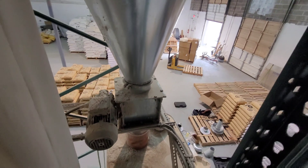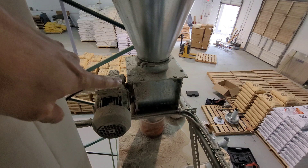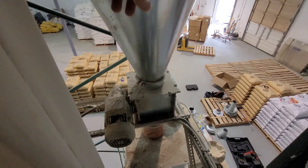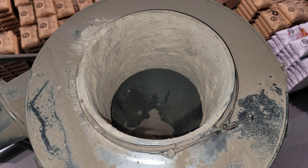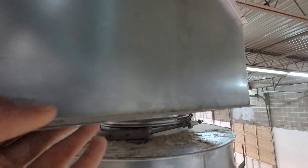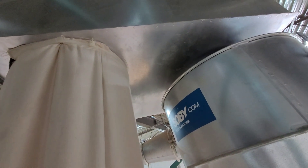So this is the cyclone here. At the bottom there's the paddle wheel gearbox to block off air at the bottom of the cyclone, but the paddle wheels allow the flour to pass through. The top of the cyclone, which is currently disconnected, just has this big 12-inch opening that passes straight up into this box up here. The problem with this box is it has a lot of flat surface area and it accumulates flour, piling up really high.